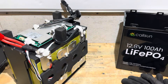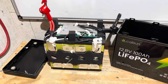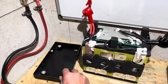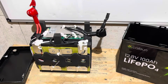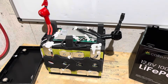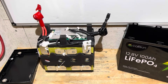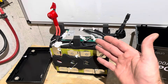The battery does have an NTC sensor. I don't know if it's got high or low temperature protection because I'm not filming with this battery anymore — I was going to check high and low temp protection, but I'm not giving any more air time to this battery. If you can't spend maybe 20 seconds and five cents to put an M6 terminal in the right place — or get a lid with M8 terminals — that's all the air time you're going to get. A lot of people would probably have hidden that from you and snugged it up because it's such a good battery overall, but not me. I'm always going to give you an honest review.